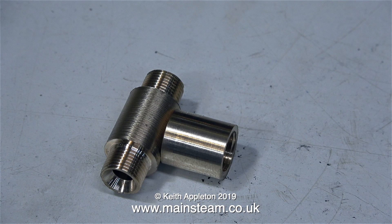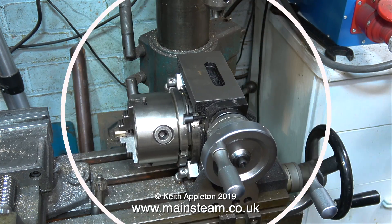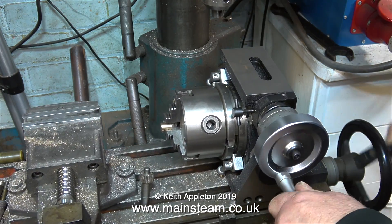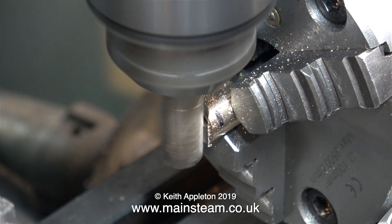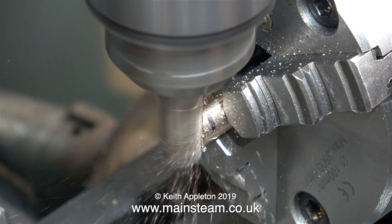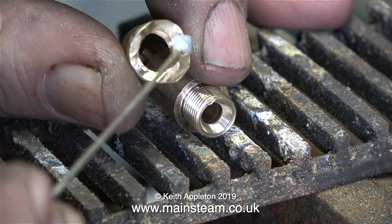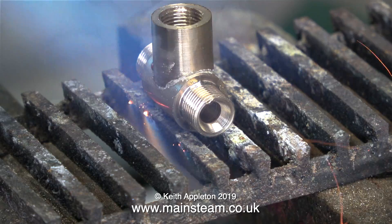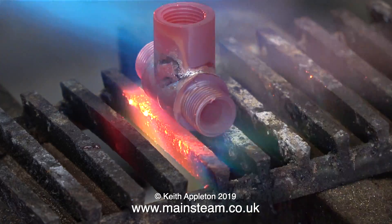I have a kit of parts. Now I need to machine the end of the part of this fitting that's going to hold the water tap. For this, I'm using my rotary table that I bought recently — it's mounted on its side, and I'm rotating it so that the open jaws are at the top, so the chuck does not collide with the jaws. I know I should be using a milling chuck, but I use this one because it never drops cutters. I didn't have a half inch diameter end mill, but I found a metric one that was nearly half an inch, though I had to move it from side to side a bit. All will be well once it's silver soldered — and talking about silver soldering, here we go.